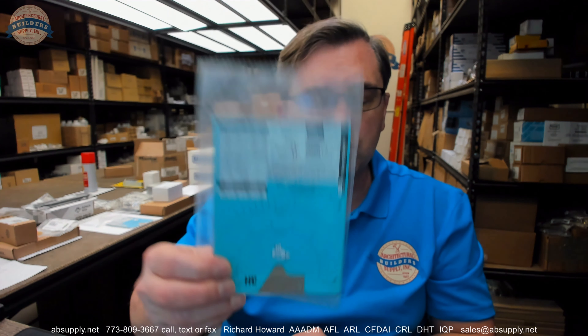If you were to imagine in your mind's eye, if you took just a key blank and you were going to have to make a key by hand, in theory you could imagine how you might take the right shaped file, and if you knew the shoulder to first cut, then center to center of each cut, and you knew how deep to file it, you could make a key. In theory you could, and in fact, locksmiths do.